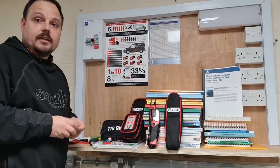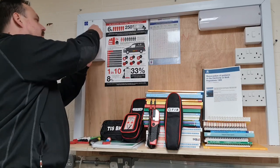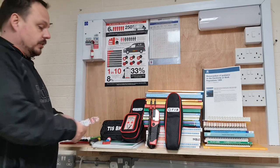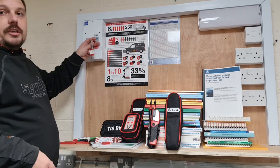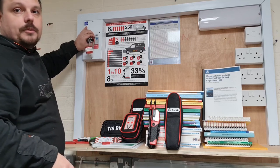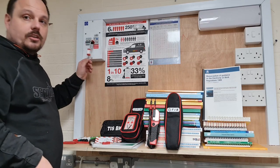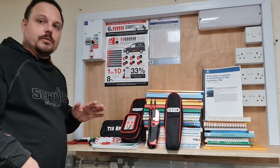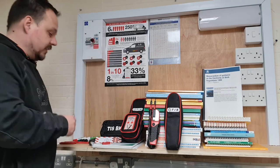If you're just working on a job on your own and you're the one responsible for the electrical system, you can put the padlock on. With the TIS kit you get a nice padlock — you can put your name and the date on there, and there's a tag to apply as well. Once that's through the hole in the black part of the toggle, you can't push it and you can't undo it. There's no way to put that switch back up and turn the circuit back on. You take the key with you and you're safe. Please run through the full safe isolation procedure — Adrian Davies has that on his channel.